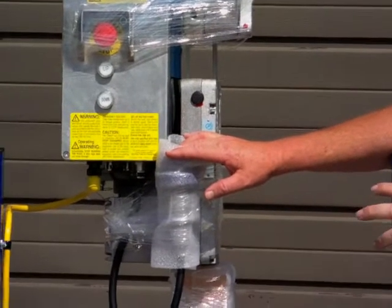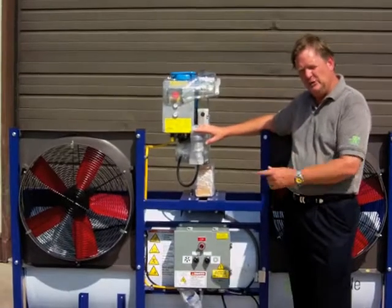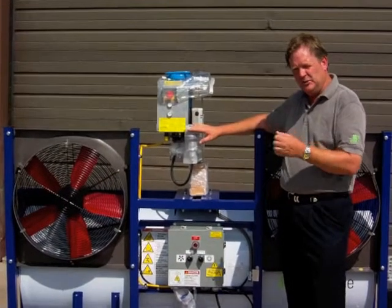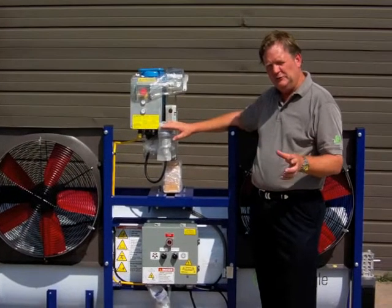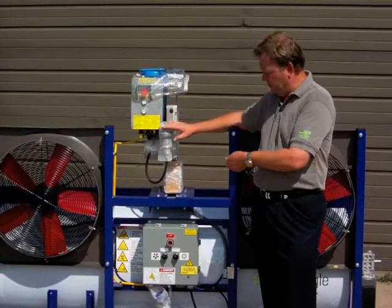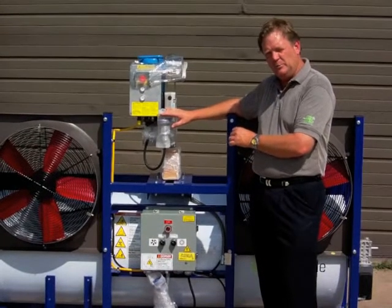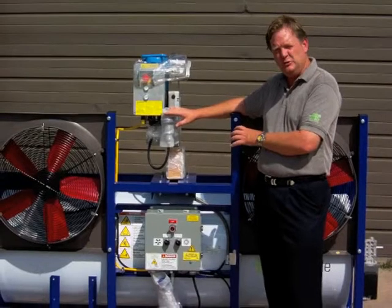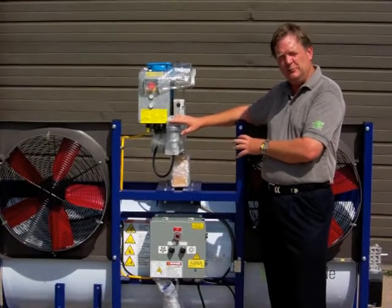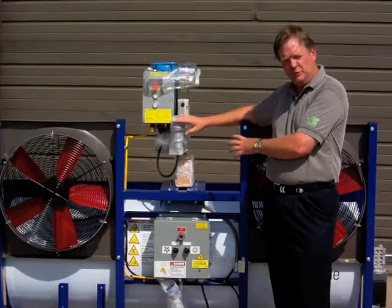The water and electricity can be run from the ground or from the roof. You use an IPC hydrocart electric to purify the water and put it into this machine. The purified water can also be commingled with a chemical injector if you need to prepare or clean the surface beyond pure water. The chemical injector is stacked onto the machine and run from a remote as well.